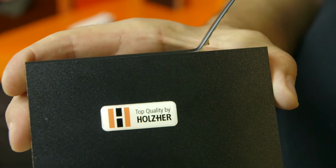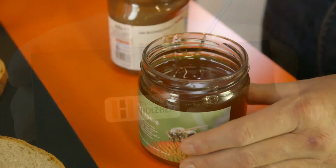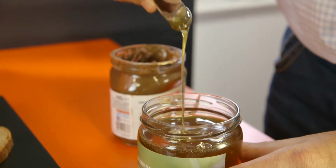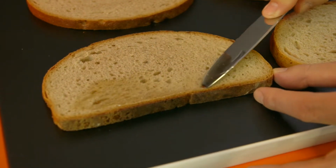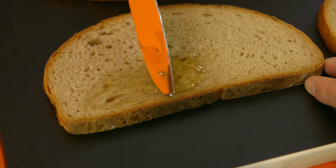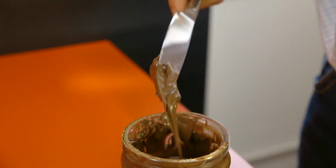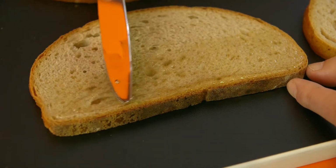Using polyurethane glue, the joint is virtually invisible, even on blacktops with black edging. To explain by using an example, the low viscosity PUR glue and sparing application are responsible for the fact that the joint is virtually invisible, while on the other hand, injecting the glue at high pressure results in a high-strength connection. Here, the loaf of bread simulates a countertop, and by applying a high viscosity and low viscosity coating, we come very close to the specific viscosities of EVA equals high viscosity and PUR equals low viscosity.